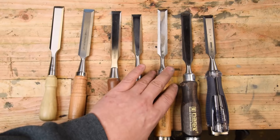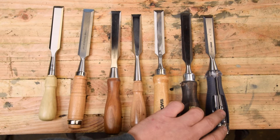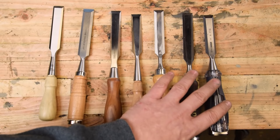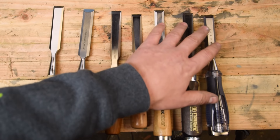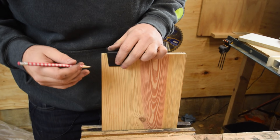The Aldi chisel — and this might vary due to inconsistencies in manufacturing — was nowhere near flat and just took a long time to flatten, though the steel was soft enough that it was easy to remove material. The Narex and the Irwin Marples were cursed by the same problem: very hard steel but nowhere near flat, so it took a long time to flatten the back, and even then I only got a small section of the front flattened. It also took a long time to flatten the bevel. The only thing that edged the Narex slightly ahead of the Irwin Marples was that it was closest to 27 degrees right out of the box.